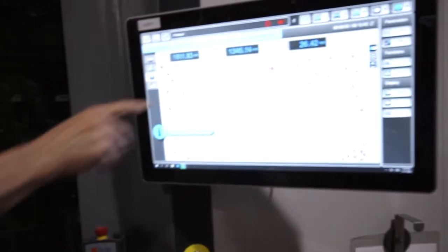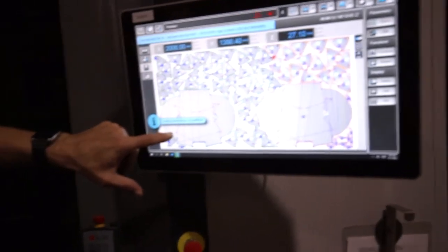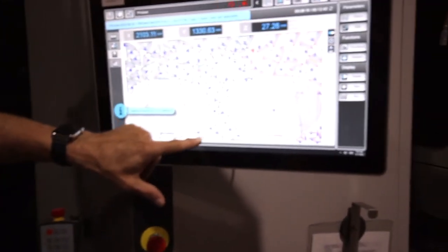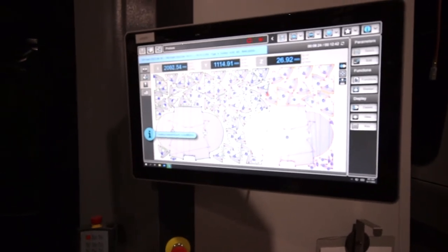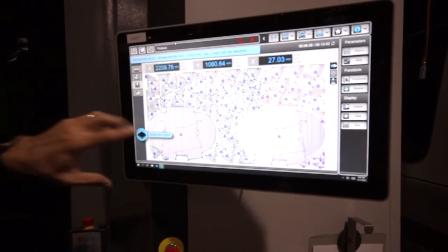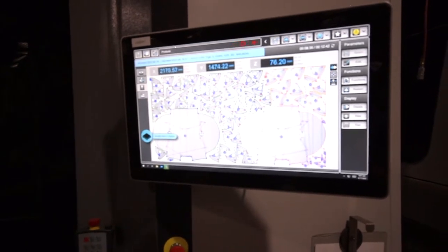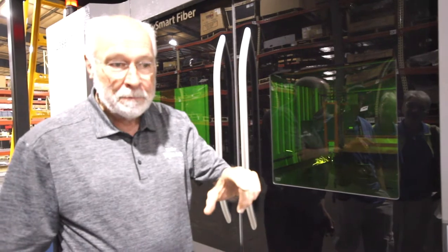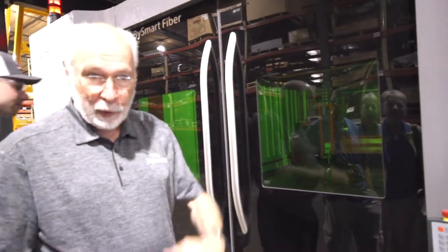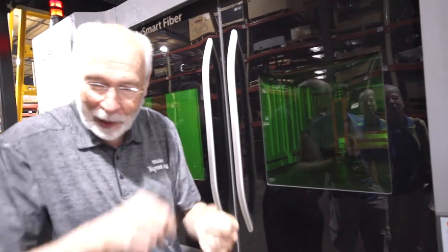Nothing is wasted. You can see on the screen where the red indicator is — that's where it's working. This is the whole sheet, and it's been nested. You've got a couple of big deck plates in here and then all these other parts arranged by an automatic nesting program. The operator tells the computer which parts to cut and how many, and the machine automatically arranges them on the sheet for the best utilization — minimal scrap. They typically run about 25% waste and 75% good material into the part, sometimes a little better. Every hole cut in a part counts as waste. It makes them smile thinking about how long it used to take to make these parts the old way — this thing can cut something in a hurry.